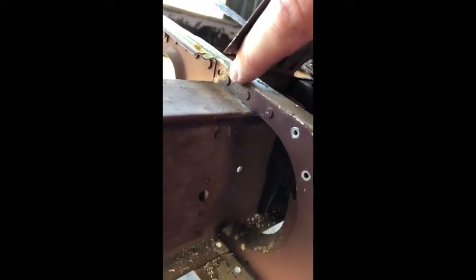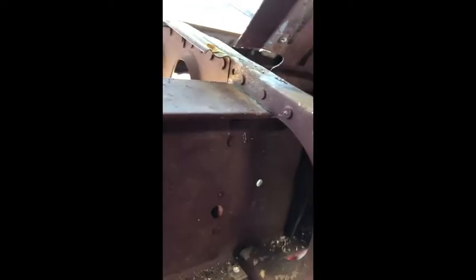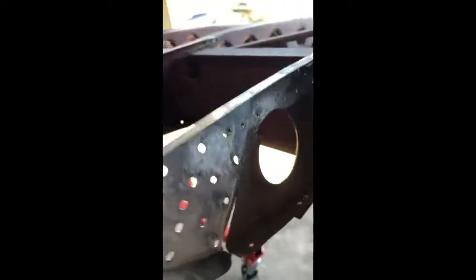The problem is I've got these three rivets right here - one on top of the spar and then about seven up through here - that I can't get in with my drill. I'm going to need an angle drill or something to drill those out, because it's too difficult from this side too. Bucking all these things is going to be a joy. I might do some cherry rivets - some blind rivets - here to help too, but it's almost out.